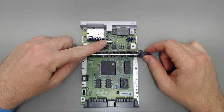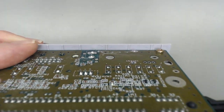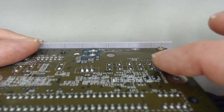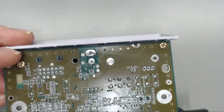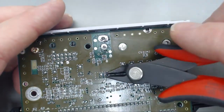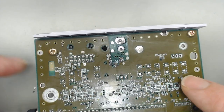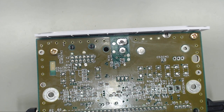From the factory, the legs on these capacitors aren't trimmed very much — they're sticking way out — so I like to come by and just trim them down a little shorter. It makes it easier when I'm coming through trying to get these desoldered. I'll trim the legs of the 7805 voltage regulator as well. Then I like to add a little bit of solder to each of these before I use my desoldering station.